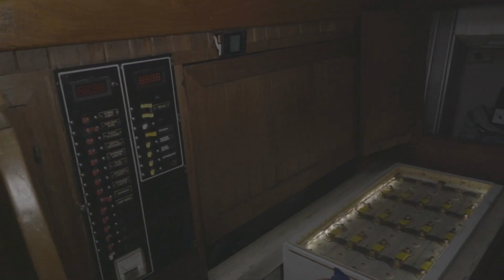But it's a battery monitor, and it does have a low voltage alarm, which is really nice, and the alarm is really annoying and loud, and that's what you want. But at any rate, I don't know if you can see what the settings are. It shows every cell. So it shows 4 cells on there, and those are the super cells, and you can see they're discharged down pretty far. I'm going to need to charge her back up here pretty soon, but yeah, it works really good, and it tells you how out of balance they are.